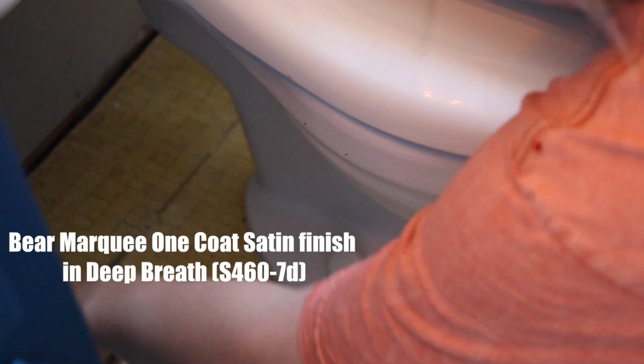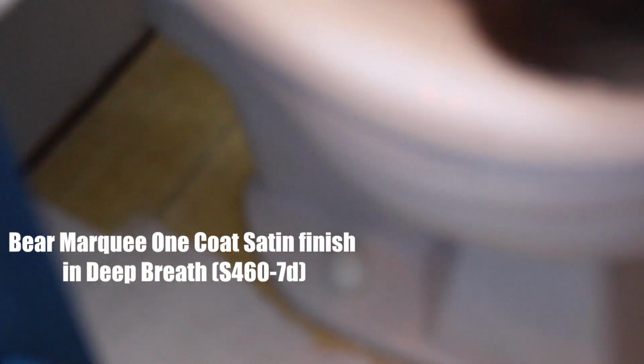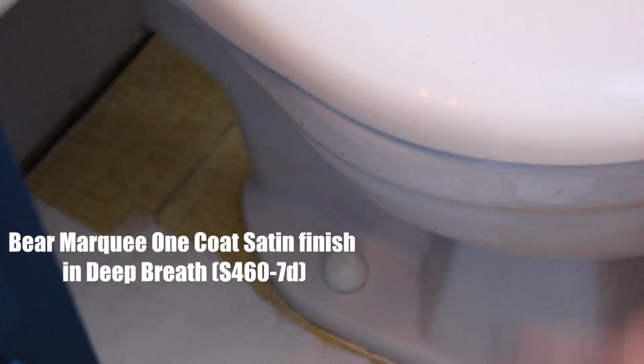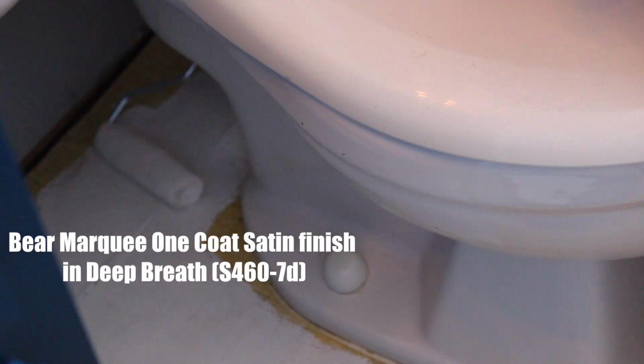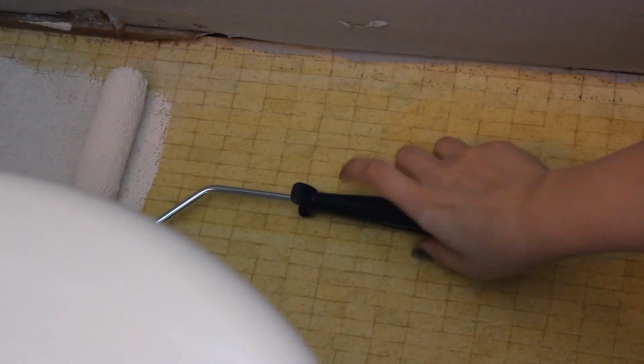Now, the sealant reminds me of a wood finish stain, at least that's what it smells like. It's very similar in concept, a varnish or a lacquer that goes on top of your floor to make sure that it doesn't scuff or chip away over time. I'm going in with this floor paint by Rust-Oleum in Ultra White, in really thin coats, and I'm working it through with a roller so that it gives a nice even texture.